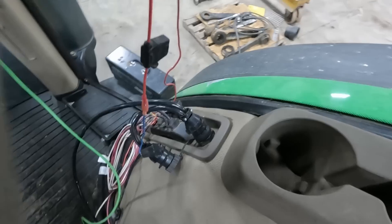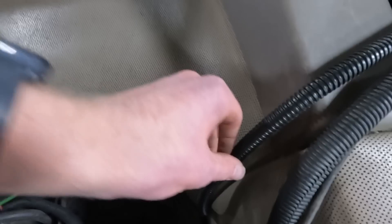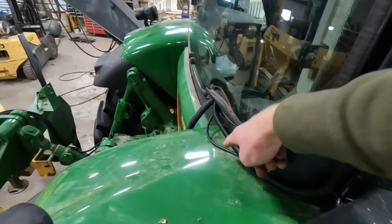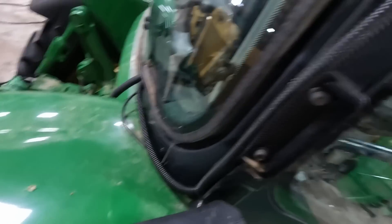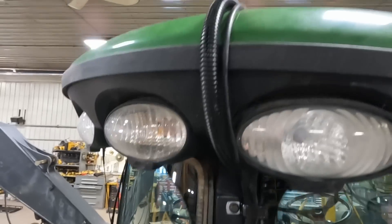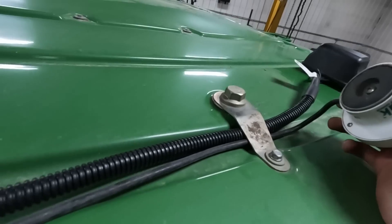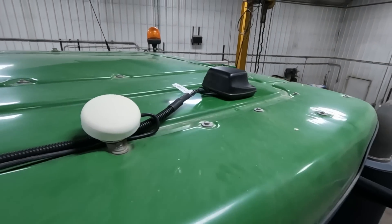And then I have the diagnostic port plugged in right there. And the cable that goes to the monitor is just hanging from the bracket because I don't have a monitor in here yet. The antenna harness is coming from underneath that mat out the back window. And then going up the side of the tractor, here's the antenna cable. We also have our velocity sensor for a rate controller coming up the side of the corner post — I have a P-clamp right there. It goes up on top of the roof, another P-clamp, and I put it underneath that bracket on the roof. There's the velocity sensor and there's the antenna for the MTG.